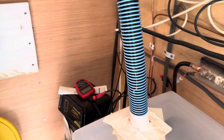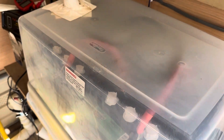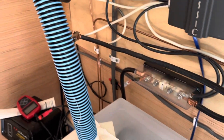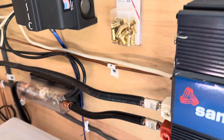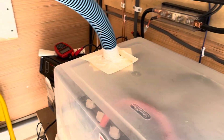An important safety point: lead-acid batteries produce hydrogen gas while charging. So I created a shell out of a clear tote and I vent the hydrogen gas out through the roof inside the house, so that while the batteries are charging any hydrogen gas gets evacuated out.